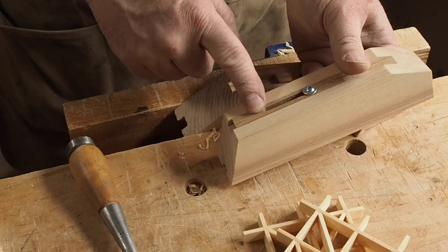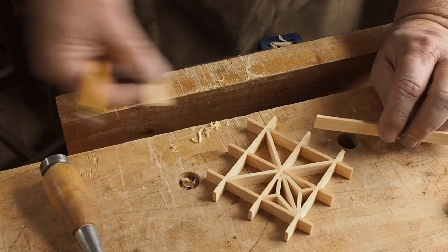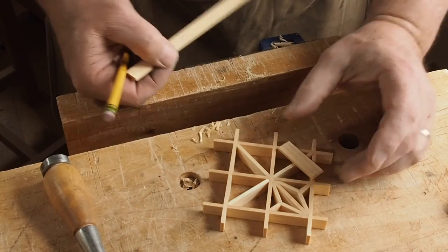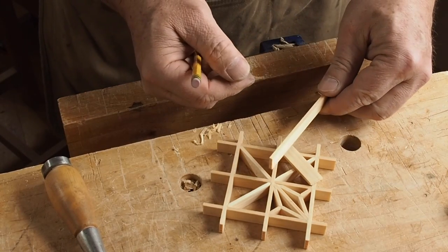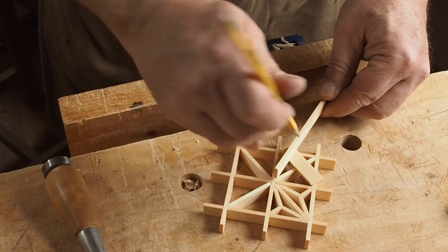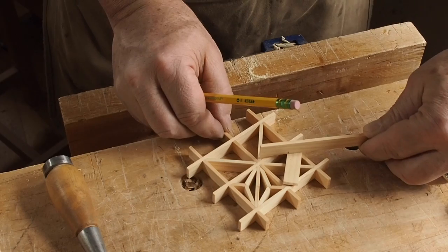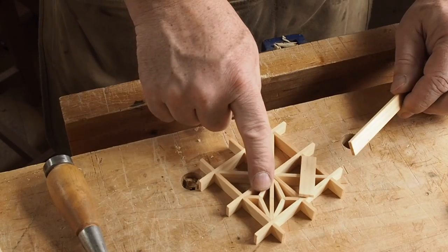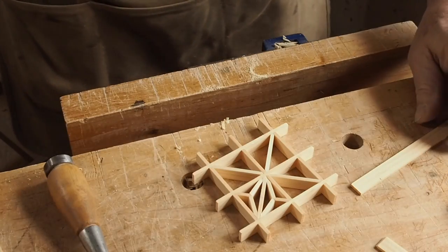That's why I want to use both of my 67 and a half degree ends in conjunction with each other — the stop blocks are slightly offset to create a bevel that's slightly off center. Probably sounds more complicated than it is. The first step in making those little wings is to cut the pieces to length. I hold a piece of stock corner to corner to find my center line, angle it to split that angle, mark where it meets the center, and make it just a little bit longer. I need four per corner, so in a small pattern that's 16 — I'll cut 18.